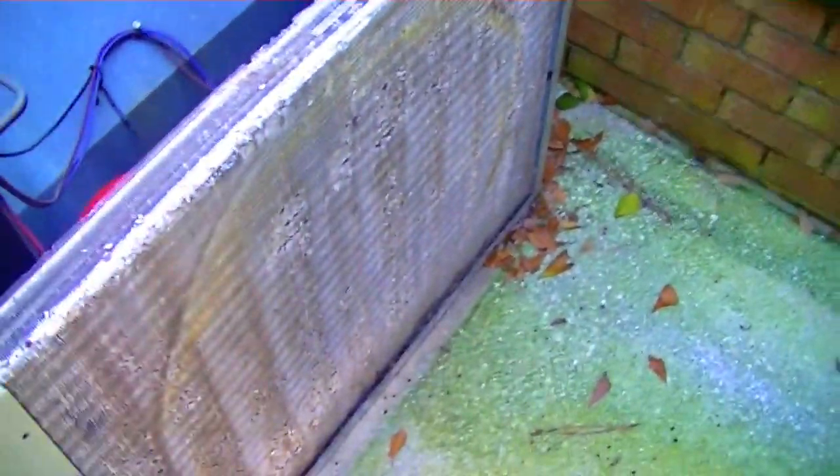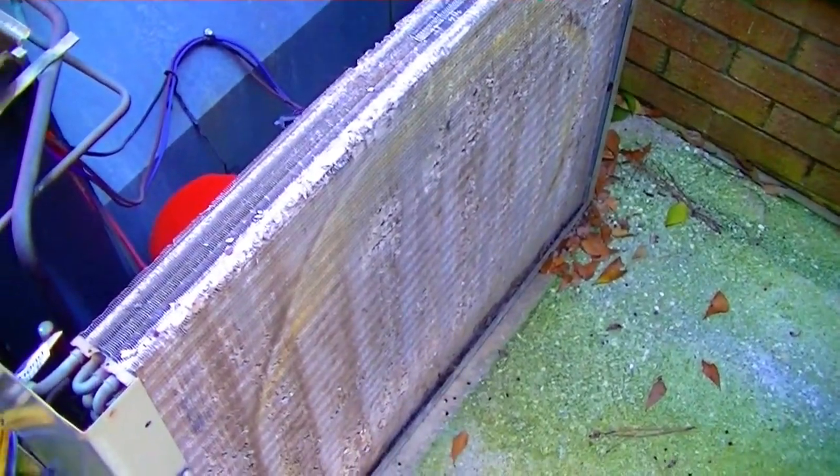We're about to leave the house. With a cracked heat exchanger, you definitely want to turn the gas off and the power off, and let the homeowner know it's not safe to run. Don't ever leave that thing running. I called them, told them the situation, and told them I couldn't work on it. It's a free country, but it won't be me killing everybody in the house. I suggest a lot of caution dealing with that sort of thing, even when customers get pretty angry about it.